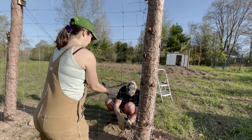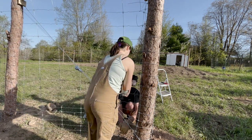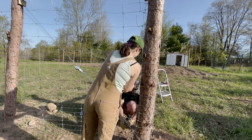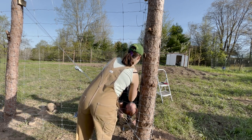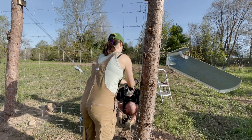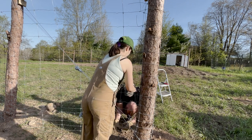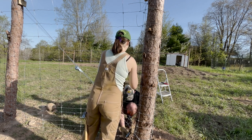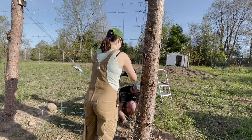Now that we have a bit of fence unrolled, we need to secure one end to itself. We do that by looping around the end post with each of the 20 lines of fencing and then wrapping it to itself three to four times. We really suggest you use these small twist tools as they will save your hands big time — we'll leave a link to them in the description below. Once tension is applied to the fencing, these wraps will tighten up and hold the fence firm.